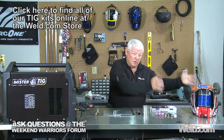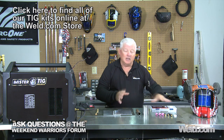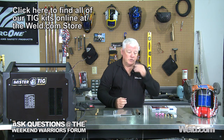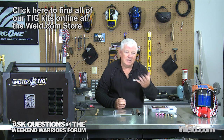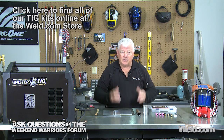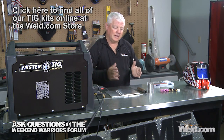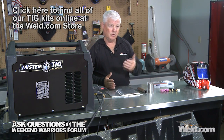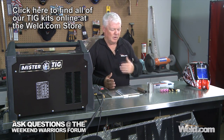We have other kits as well. One is for really super micro welding using stereo microscopes — it'll include an 020 diameter tungsten, and you'll be welding at 2 amps, which requires a microscope to see the weld. We're also going to jump it up for heavy-duty welding — a 1/8-inch diameter tungsten that handles up into the water-cooled range at 225 to 250 amps. Beyond that, you'd be doing multiple passes.